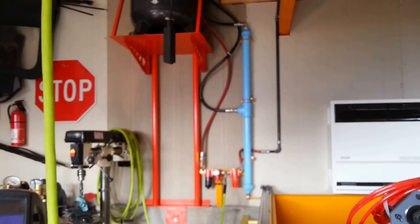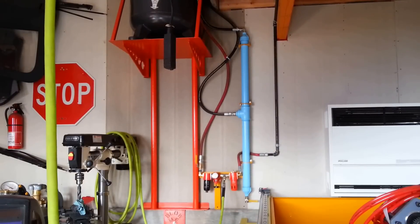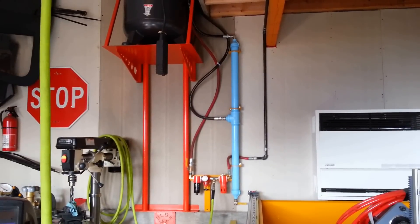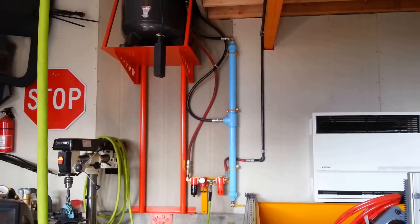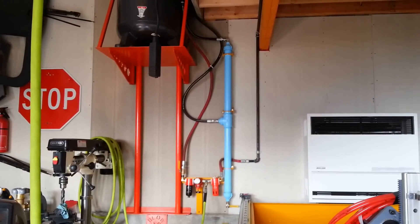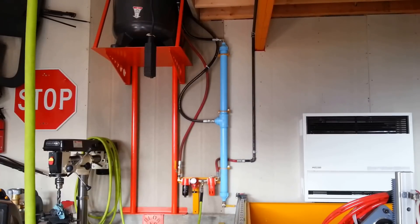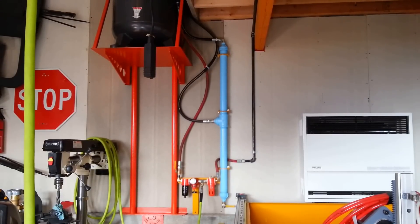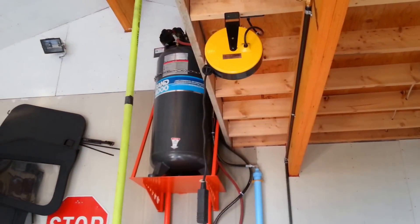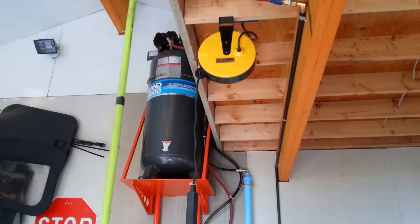Over on the far wall here, the vertical blue column is my air dryer. It works quite well. There are many drawings on the internet for something that works like this. The middle blue T-fitting has a black line running into it from the left — that is the high pressure line that comes right off the head of the compressor, and that is compressed atmospheric air.